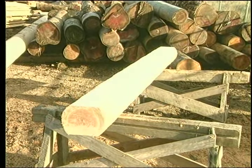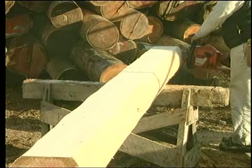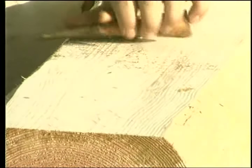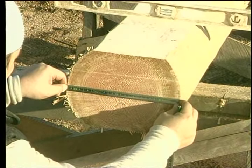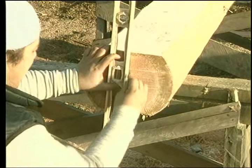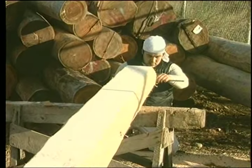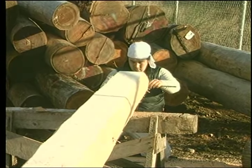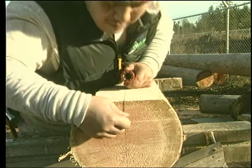Place the material on blocks at a convenient height, and if the end lines are not already in place, carefully level the flats and draw these lines. Snap center lines on all 4 sides.